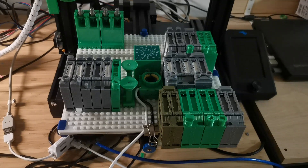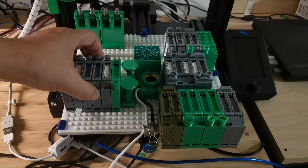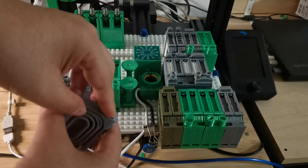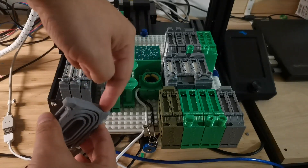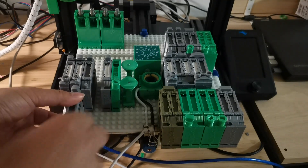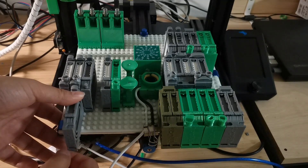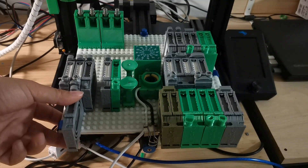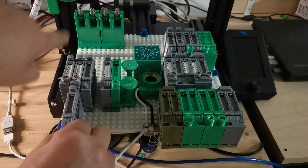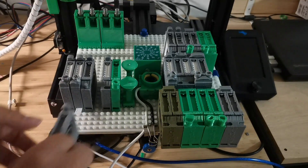When you rotate you'll see the component moving out longer and longer. You might wonder how this works with multiple rows. There is a space here, so the component in the front goes into this hole and exits from the back. If you put a component here it moves in from the front and goes out from the back. This means you can mount multiple rows — as long as you align the feeders, you don't need to worry about components having nowhere to go.